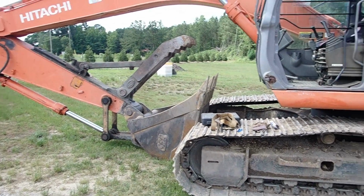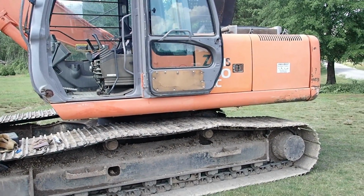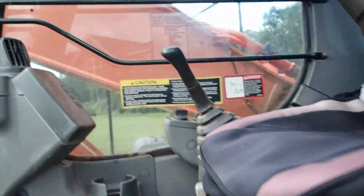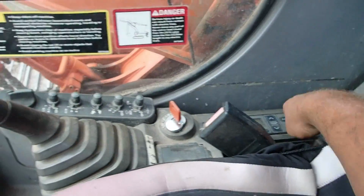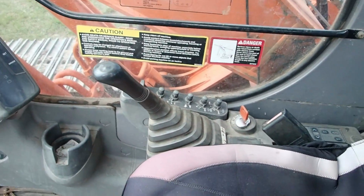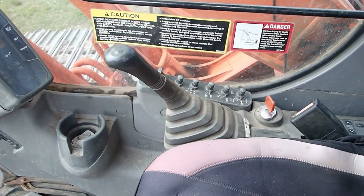Well, I folded the thumb down. I've been letting it run for about 10 minutes, about 3/4 throttle with the heat on. I bet it is horribly hot in here now. Oh, and it is. Let's cut that off. That way it'd flush out the heater core. Idle it down a second. We'll go drain it out into a clean bucket and see how much crud comes out.